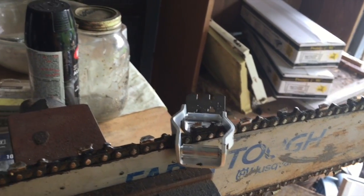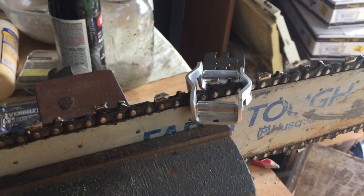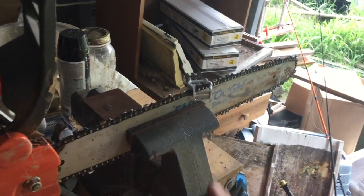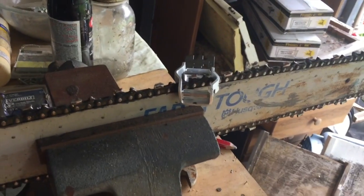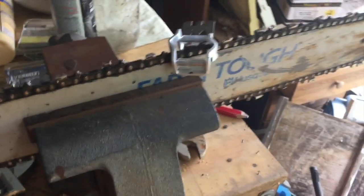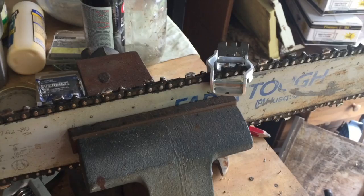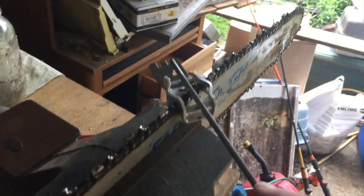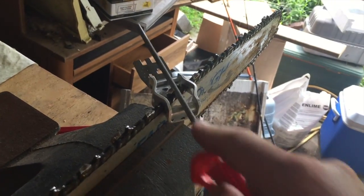You want to make sure you sharpen them the same amount on each side of the chain to keep it from curving. I did have a saw once that did that and, to be honest, I thought my bar was bent or something. It would cut like a concave angle — it was an old inexpensive saw many years ago and I didn't know what was wrong with it. So if you see your saw cutting crooked or curved, it may just be your chain isn't sharpened up evenly. You can do the same number of strokes or pushes — just one, two, five — and that's it.